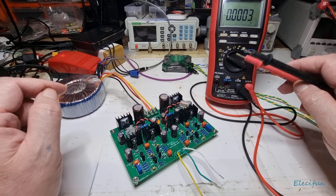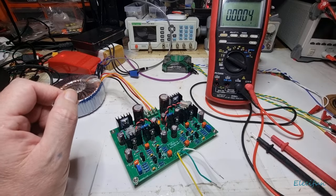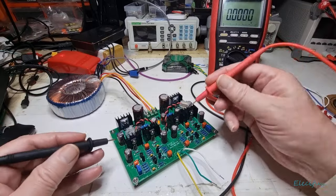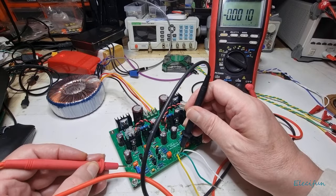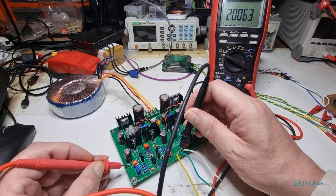I've left this powered up for about 10 minutes. Looking at these voltages — on the screen we're going to adjust the 20k pot. This makes plus 20 volt DC between both ends of A and G, where A is the anode of the zener diode and G is our ground on the input. That's reading 20.063, which is good enough.